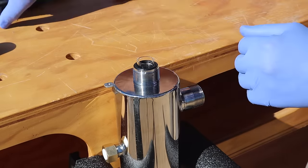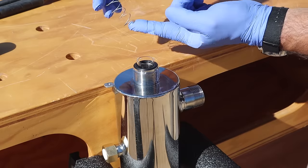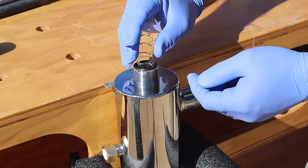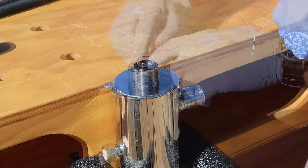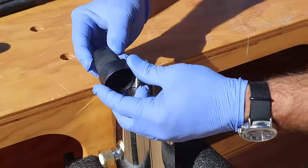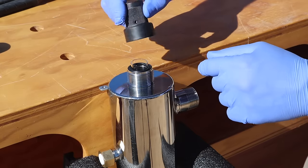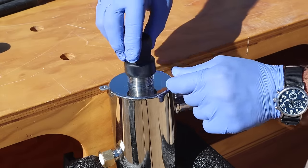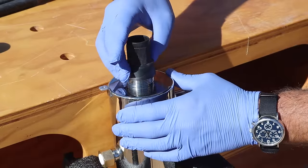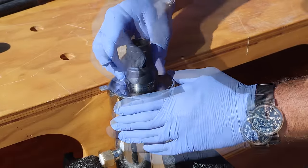And the next thing I want to add is this little spring. And this is what the bulb is going to be held in place securely within this sleeve on. So I've got my O-ring set within that groove, and then I just need to add this cap, and that is going to seal the water from getting inside this quartz tube. And they say that you just do it hand tight. So no tools, no tape, because the O-ring is what's doing the seal.